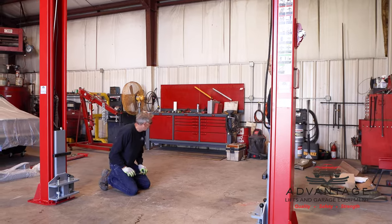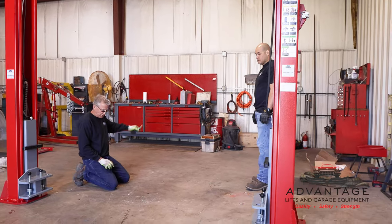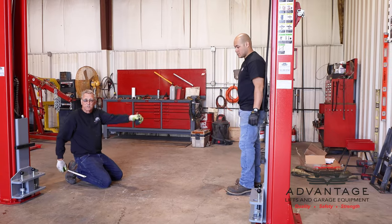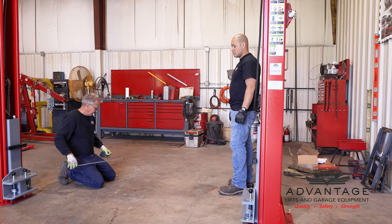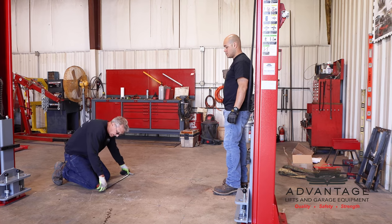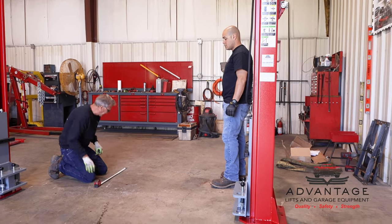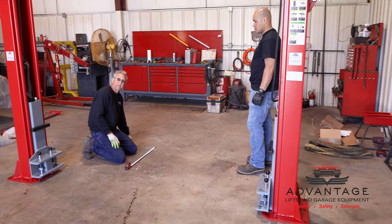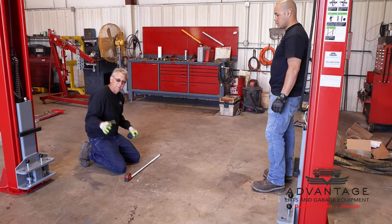Okay, now we've got our measurement of 11 feet from our nearest obstruction. So what we're gonna do is we're gonna put two marks at that distance and put a chalk line. That'll be our straight edge. So to make the marks, I'm gonna go off this joint here that I cut in the floor. It's 26 inches back. Now I know this joint's square to the wall because I marked it and I cut it myself. And let's talk about that just a little bit.